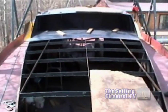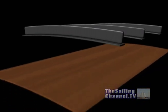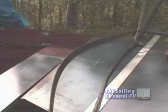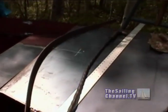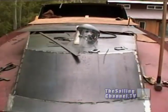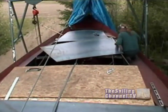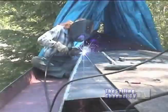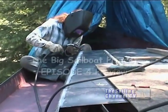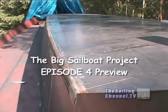While I was doing that, Gina was teeing the cabin top frames and preparing to put on some cabin top plating. Teeing is just adding some flat bar to the bottoms of the frames so the interior can be attached. The plate was laid over, traced from inside, and cut. The forward edge of the cabin should flow, so we decided to have a nice round curve. Welding had to be done with care because the plate joins in between frames. The split pipe was carefully smoothed in, and once it was ground smooth, showed a very fair curve. That's eye candy to us boat builders.